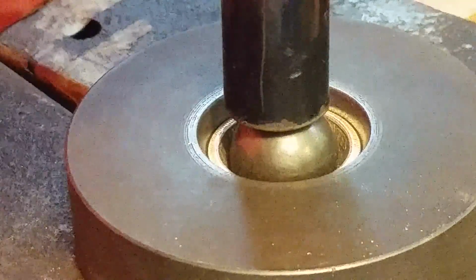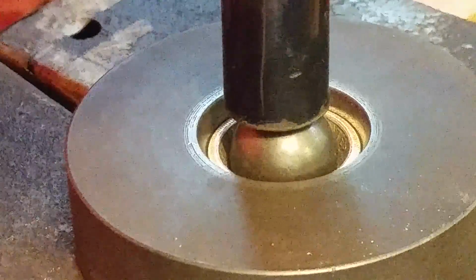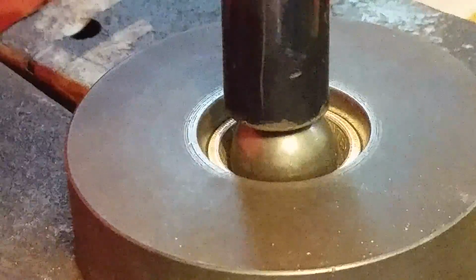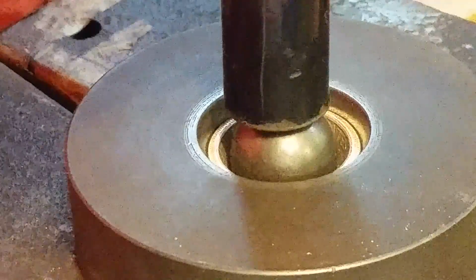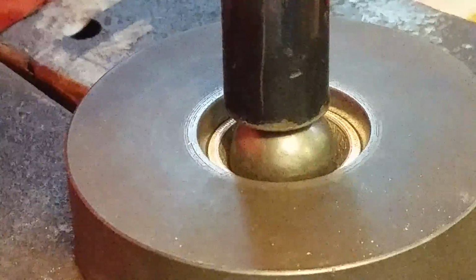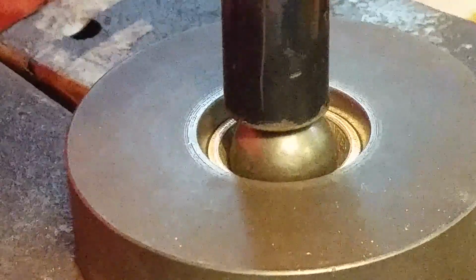And with coin rings or anything else really, you're talking about consistency and regularity. So here I know exactly where I'm at as far as the bending process. It usually takes about 2.5 presses on my press to get it all the way down, almost touching the inside of that die without touching the coin. Because if you start touching the die to the coin, you lose detail, so you don't want to do that.